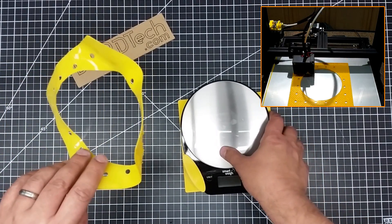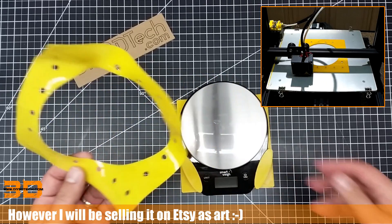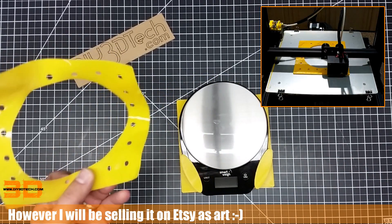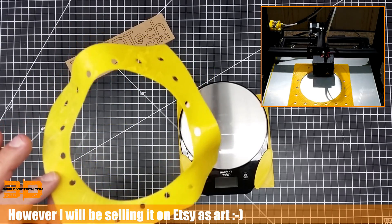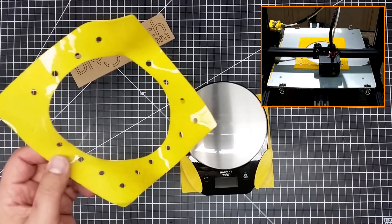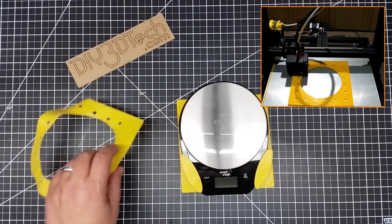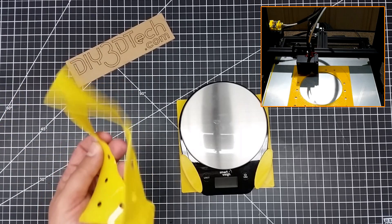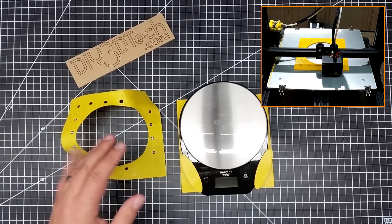However, this version didn't. Unfortunately, one of the things about this cheaper PLA is it gets jammed on the spool. This is a byproduct of it jamming on the spool — I set it to print, went back to my office for a while, came back about an hour later, and this is what I had. It didn't work too successfully because the cheap PLA got jammed.